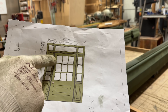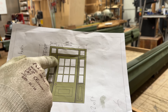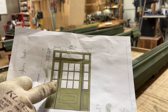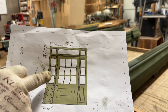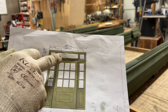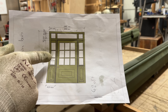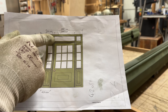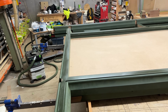I've got basically the transom glued into the door jamb uprights. I need to make sure they're nice and square at these joints. Once I've got that assembled and the glue's gone off, I can take out the clamps then glue each side on — the glazing bars, rails and jambs — and clamp with smaller clamps. I've got time to fettle these so they all sit nicely. Then once that's dried I can attach the top rails and the head and clamp that all through. Let glue-up commence.